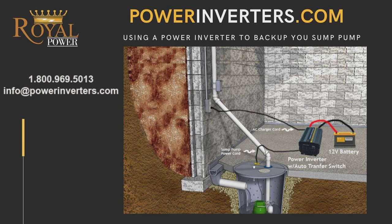After these steps are all completed, that's pretty much it — it'll run all the time. You leave it turned on all the time, so that when the power is lost, it'll switch over to battery power. When utility power comes back on, it'll charge up the batteries and then go into a float mode. The inverter's AC outlets stay powered all the time, either running off the utility through flow-through power or directly off the batteries. So as long as you have enough battery power for the length of the blackout, you'll essentially never lose power, because it'll switch back over when utility returns.